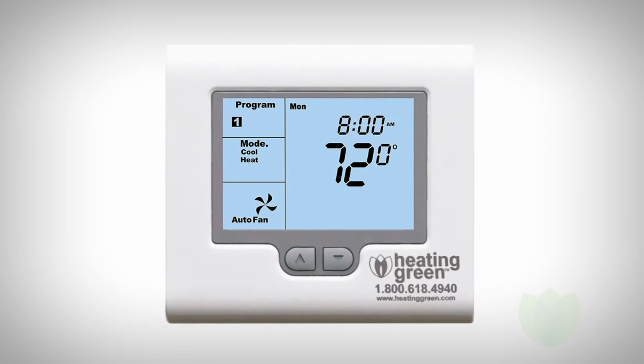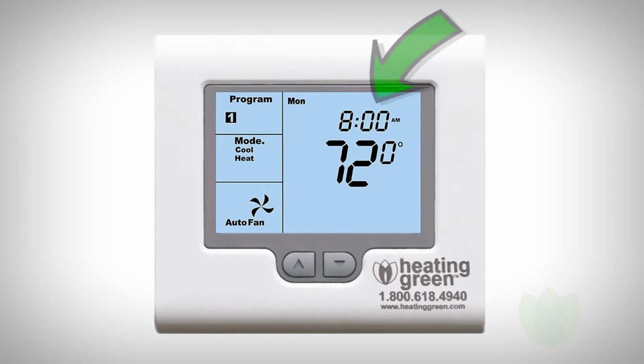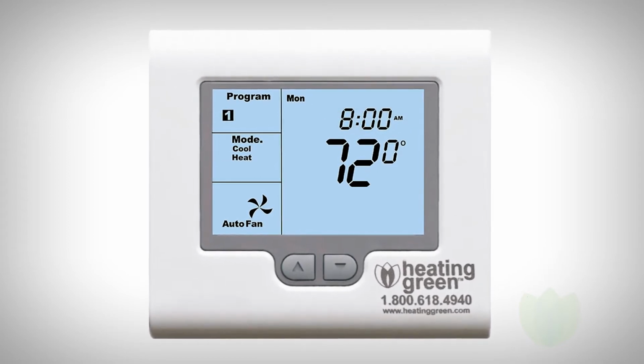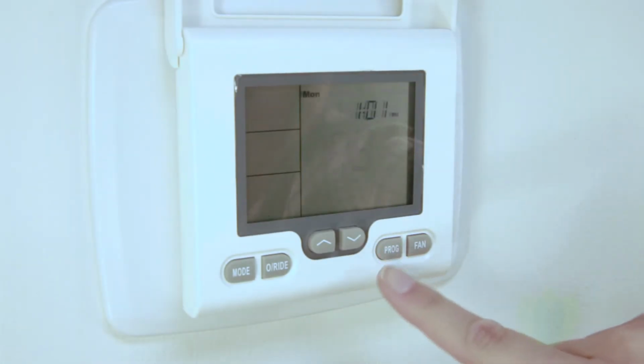The HG122 has a clock that is used for programming. It is important that both the time and day are set properly so that the thermostat will run correctly. To set the clock, press the program key.